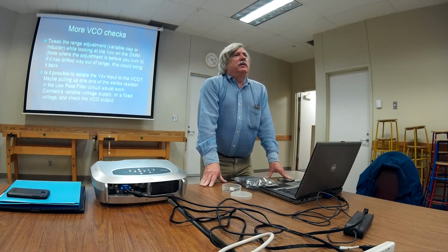Yes? So I've been looking at some old Motorola Astro portable radios, and they do the laser engraving on the inductor to tune that radio in there when they're shipped out. You get to feel out the lock on a particular band. Yes. I want to reband the radios. You know, they might be at 460 megahertz. I want them to work at 440 megahertz. The guys that work at the Motorola factory in Phoenix are telling me, get your silver solder pen out, and it's quite a process. But I read online, somebody said you can use a pull-up or pull-down resistor on the VCV input. Basically drop an SMD resistor and pull the frequency and move a radio in the band that it operates on. And it's contradictory information, but I'm wondering, do you have any thoughts about that?